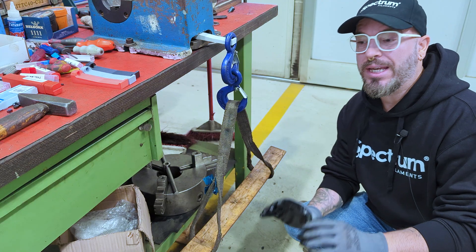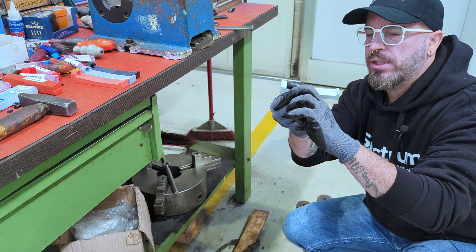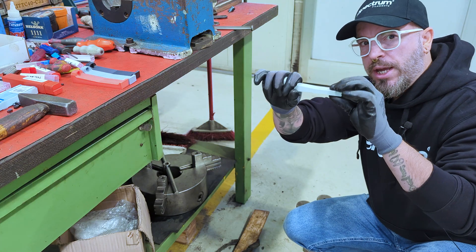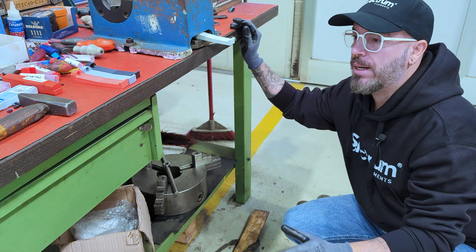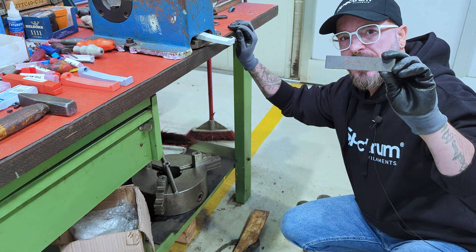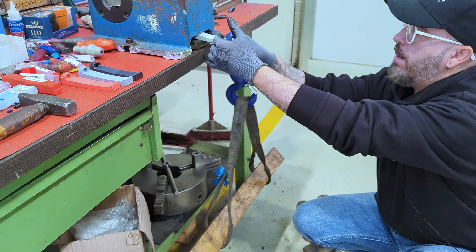Today we're going fully industrial for this test. We have already placed the PLA bracket — it was supposed to be mounted on a wall with a screw, but all the pressure and weight would concentrate at one point and break right there. The contraption itself is probably one kilo or a little more. Then we're going to try PETG, then PLA CF (PLA carbon fiber reinforced), and finally PCCF, polycarbonate carbon fiber reinforced. We'll start adding small weights at a time to find the breaking point.